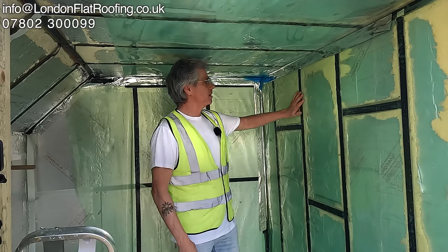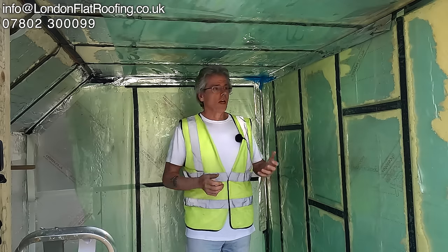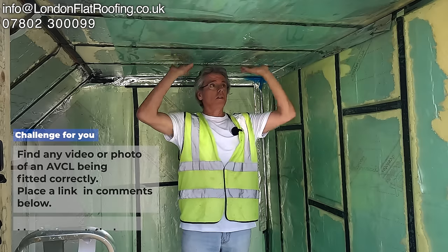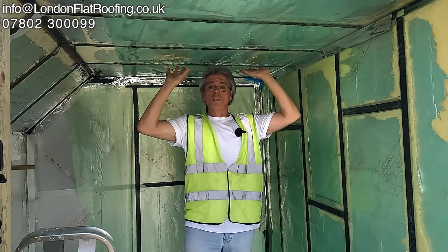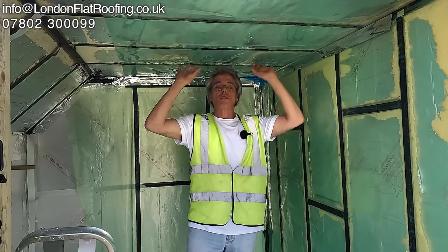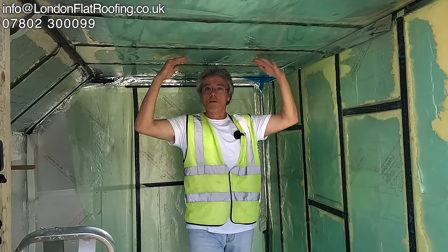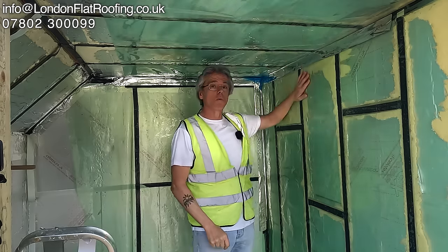I've set up this rig to demonstrate how to install an air vapor control layer, not only on walls but on a cold roof. I don't do cold roofs — I only do warm roofs. Building control says warm roofs are the way to go and you should stay away from cold roofs, but everybody seems to want them, especially in loft conversions. That means you've got to put in an internal air vapor control barrier — above this you've got insulation, and with air movement back and forth, it has to be completely airtight, same as the walls.